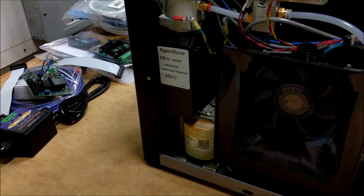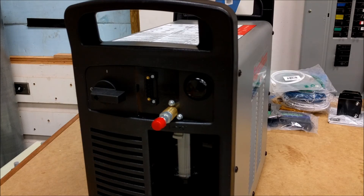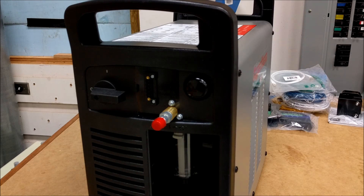I've got the cover back on the Hypertherm and we've completed all the steps to install the RS-485 serial communications card into a Hypertherm PowerMax 65. The part number is 228539 — that's the RS-485 serial communications kit for the PowerMax 65 and 85. This is Mike signing off.